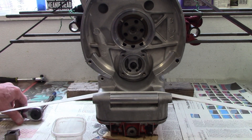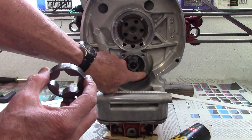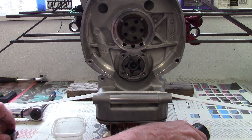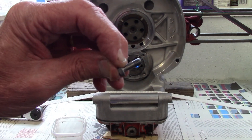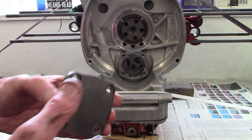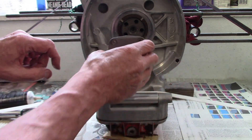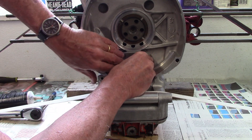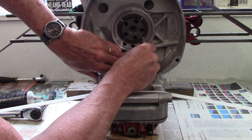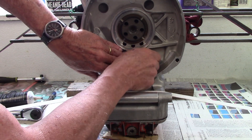That's all there is to putting it together. I have the outside surfaces of the rotors and the inside of the pump all ready to go. The cover has a slightly beveled edge at the top, and the bolt pattern is not symmetric — that guarantees the cover goes on correctly. I'll lay that in, put my bolts in, get them started, and then torque them up with the torque wrench.